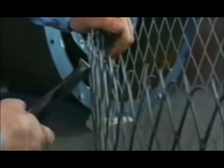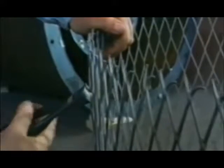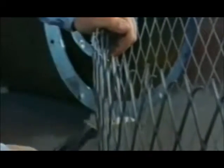The distance between the net and the steel base can be maintained by welding round iron bars of the appropriate thickness to the base and the net. The distance between the iron bars themselves should be about 200 millimeters. If the distance is greater, the net may not be rigid enough, making it difficult to apply the Densit material. This is especially true of vertical surfaces and of upward facing surfaces.